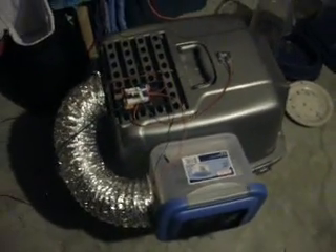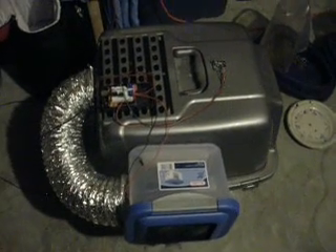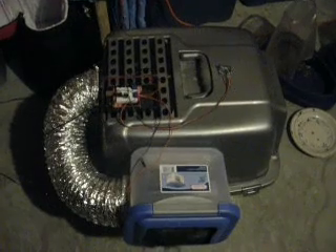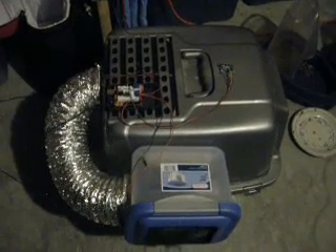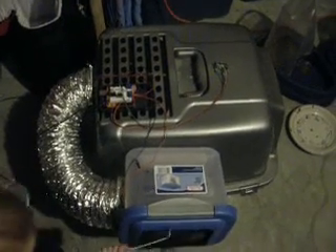What happens with the code is the cats go into the box. The PIR takes samples about every 10 seconds. If it's high, it outputs a value of 1; if it's low, it outputs a value of 0. Those data samples go into an array which gets summed.